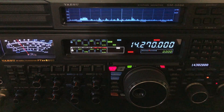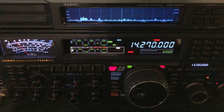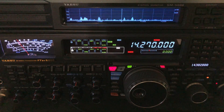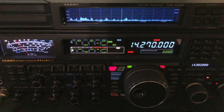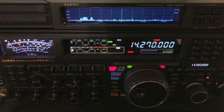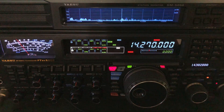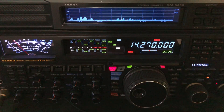Just be aware: noise blanker affects the selectivity of the receiver. In all honesty, not all noise blankers are created equal. I do find that even though this is a more modern rig handling the noise blanker in the DSP, it's better than a lot of the others. I hate to say it — I love Yaesu radios and I love my FT-891 — but that noise blanker in the FT-891 is absolutely embarrassing. I know I'm picking on the 891, but radios from other brands also have terrible noise blankers managed by the digital signal processor.